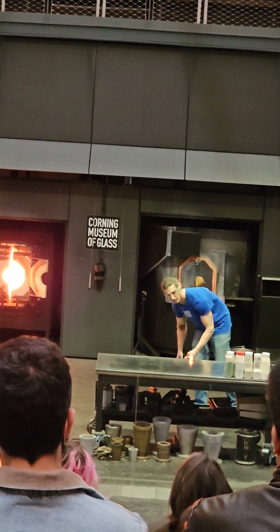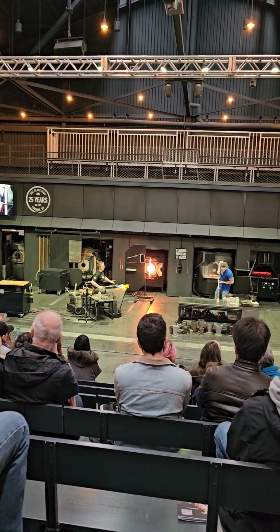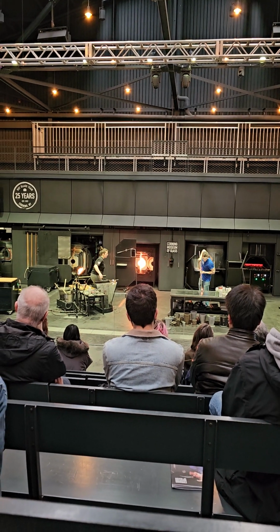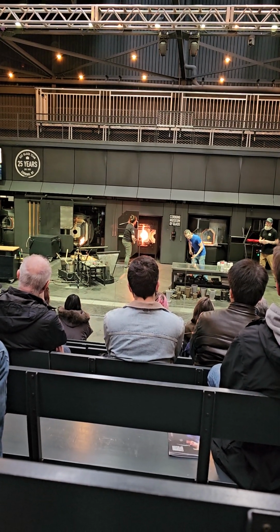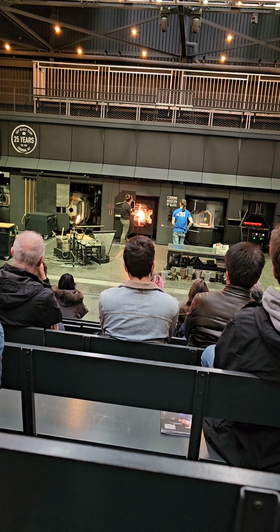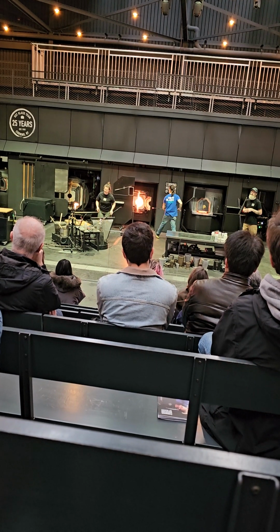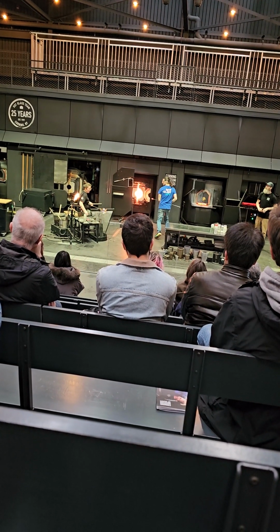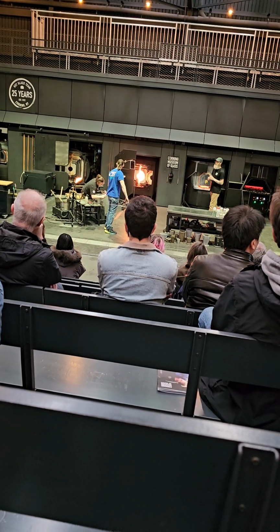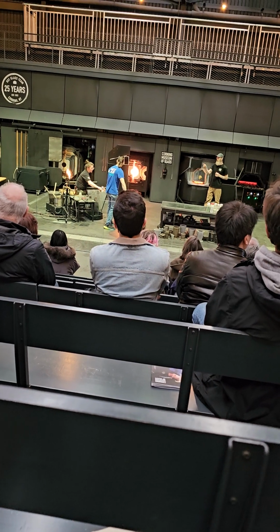So we often refer to glass in terms of bodies and food. So eggs are really important to us when it comes to glass blowing. We have that pointier side of an egg and the more duller side of the egg. What he's looking for is more of that pointy side of the egg. What that does is it gives us a small connection on the bottom of her vessel so that that becomes the weak link. So when this is ready to be finished and put away into our cooling ovens overnight, that's where it'll want to separate. It will want to break at this weak link because this is about the touchdown of a dime, maybe the size of a dime. Just that small little surface area will be holding that whole thing.